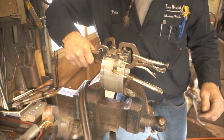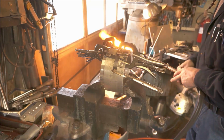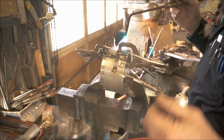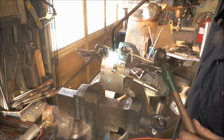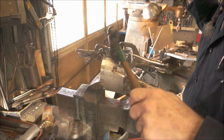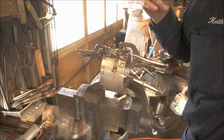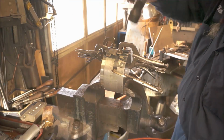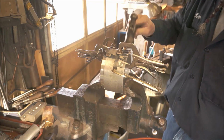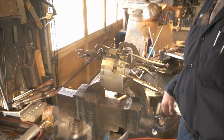Okay, we found another little clamp. And just a little flash heating in here. And same in here. Alright, and that should finalize our stress relief into the 5.5 dimension, and then it'll have a slight bit of spring back to it still, but it should be fitting tight on that 6-inch diameter. Alright, we're going to let that cool down to room temperature. We'll come back to it and we'll go check the fit on the 6-inch piece.